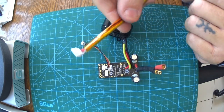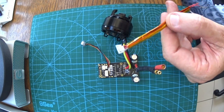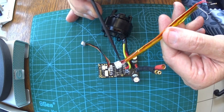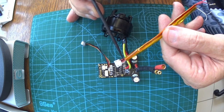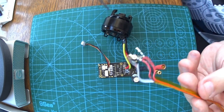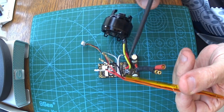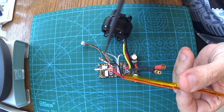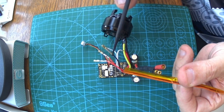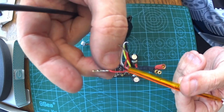This is the 5-pin connector that comes down from the flight controller. I've messed with a lot of drones and model aeroplanes — 45 years doing this stuff — so it's not new, but it's certainly different. In here we have a red, black, red wire, and then a white and a grey into this 5-pin plug. I'm assuming the reds and black are probably the PWM, though PWM only needs one wire, so two reds has me snookered. The black I can understand — that's ground.